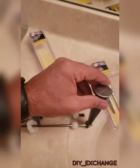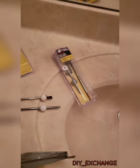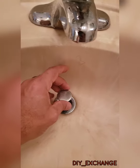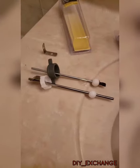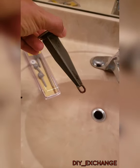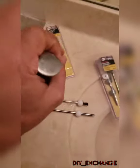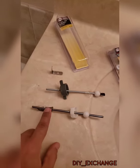Since I'm going to need both hands I'm not going to be able to show you this next step, but I'll explain the plan. Before you go back underneath the sink, you need to either place the stopper all the way down or try to hold it with one hand while you reach underneath to get the rod through the loop. To confirm it works, after securing and locking it in place, lift up or push down on the back end of the rod and you should see the stopper go up or down.